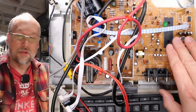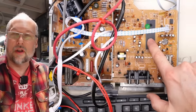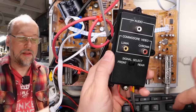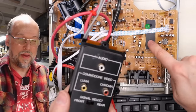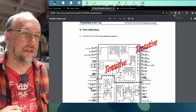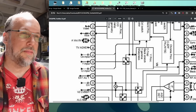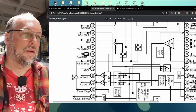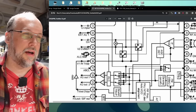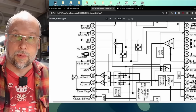Interestingly, while the 1702 has the capability to switch audio between front and rear jacks, they have it wired with a jumper link so both front and rear audio inputs are bridged together — they're actually the same. For the front and rear video input I also like to do a similar mod on all my 1702s, bridging front and rear composite video inputs so both work regardless of switch position — the switch then only enables or disables the chroma input. When it comes to the Chinese board, everything happens inside the jungle IC. There's an extra pin that takes the chroma input — we just need to run the chroma signal to that pin and install a couple passive components.